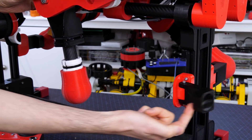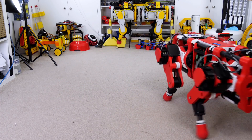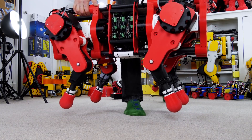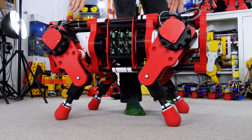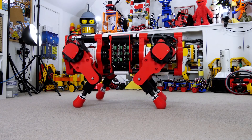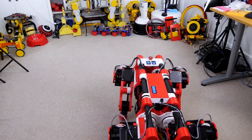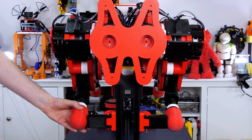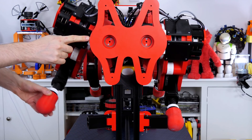This allows testing of leg motions without the stand getting in the way. At the moment the dog walks by moving the feet to fixed positions on hard-coded timers — the time to take a step gets longer as step distance increases, but it has no sense of balance. It relies on the lower gear reductions making the joints back-drivable, then tuning the O-Drive motor positioning parameters so the position gain is quite low, making the motors and gearboxes act like a damped spring. This absorbs shock and, due to the fast joint motion, the whole thing kind of averages out so it can walk along. Turning the gains up to stiffen the joints and slowing down the motion doesn't work well, causing a strange wobbly walk as the robot twists about the two legs remaining on the ground — largely due to the large sideways offset between the foot position and the hip joint, which creates a lot of force on that joint.